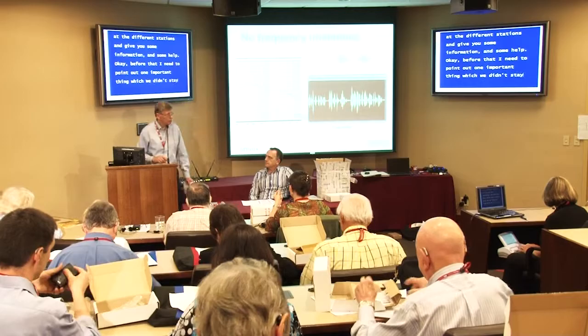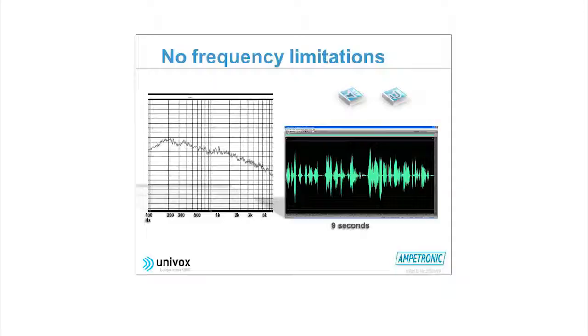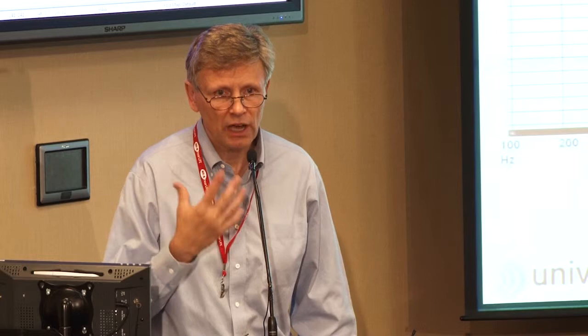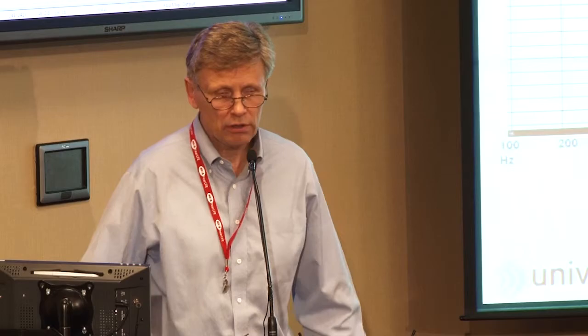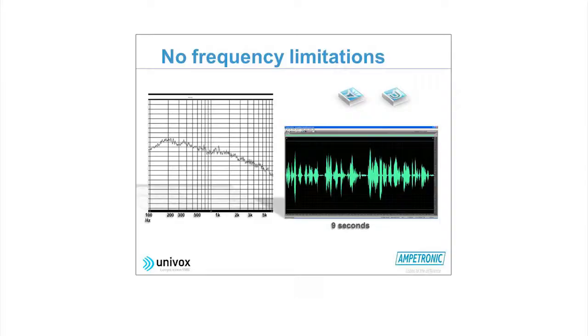If you look at the computer screen and look at the signal, the green one here, this is the signal that varies through the time. So when you have a program signal, you have a very different level all the time. It's changing all the time, rapidly. Like my voice, some of the letters or the sounds are weaker, some are higher. So these meters, they are measuring the peaks, the short peaks. If you look at the green one, you can see it will flicker. And sometimes, during a period of time, you will have a peak.